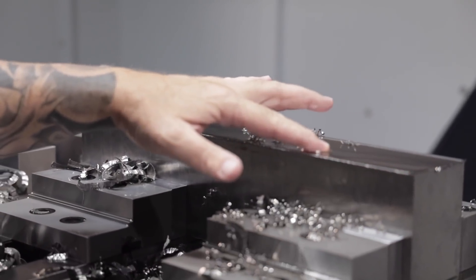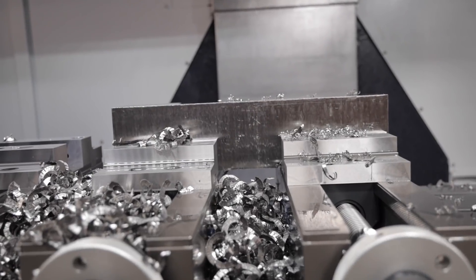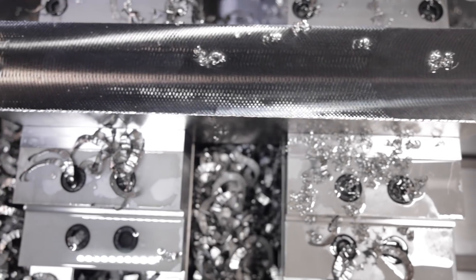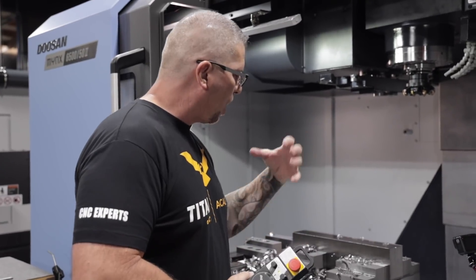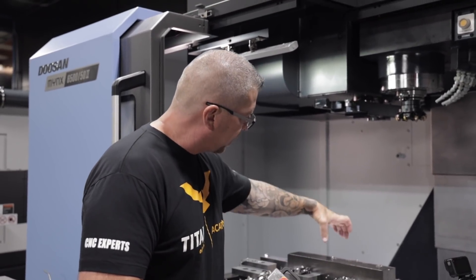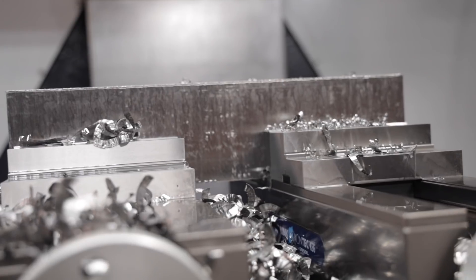Absolutely a beautiful cut right here in titanium. You can see the chips are big and kind of stringy, but that's just because you have a monster tool taking a cut right across all the way throughout. Nice and consistent, looks beautiful. So now I'll actually go in deeper outside, take it out, clean it, flip it 90 degrees, pop it down in there so this side is over here, and then we're going to take some monster cuts on the next video. If you love the education, the entertainment, and the awareness we're bringing to the industry, hit the subscribe button, hit the like button, the bell — and I'll see you in the next video.